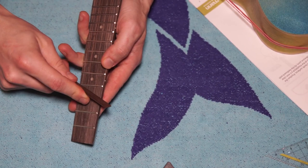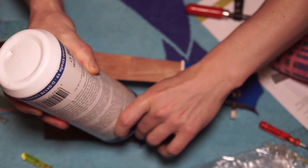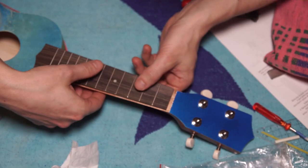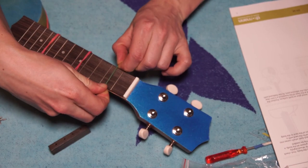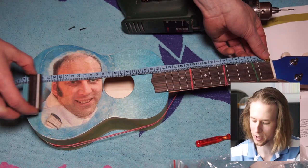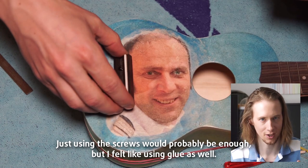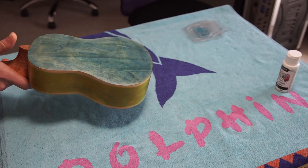The fret ends were not bad but I wanted to slightly bevel them from the side and crown them a little bit. Now I'm gluing on the fretboard, and I also glue on the nut — I placed it where the headstock started having that angle, and put on rubber bands as the manual says. The tricky part is the bridge location, but the kit came with two center-punched holes for the bridge, so I'll just put it there and hope the intonation is good, since the ukulele has no intonation adjustment. And as it turned out, you can shoot rubber bands with a ukulele.